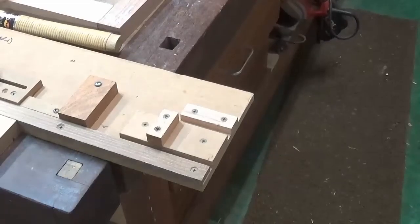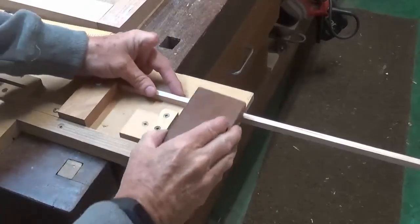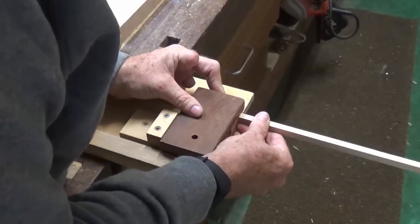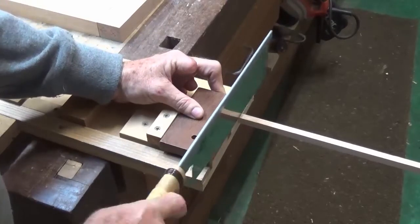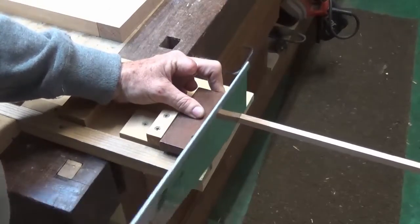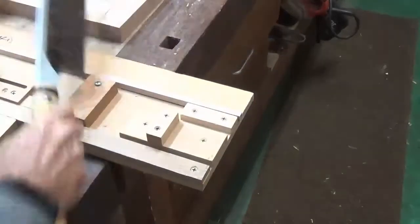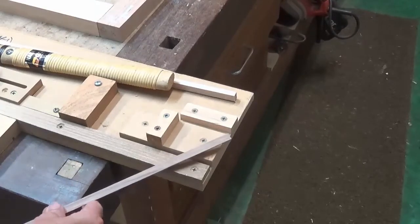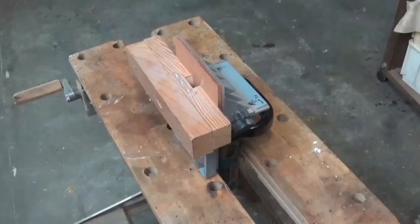And those cuts ensure that when I trim the end down to form the round spigot or dowel type end, it will always have a nice clean cut on the end. In this little segment I'm showing how I cut them to length prior to putting them into the jig to do those cuts around the end. The block that I use ensures that you get a 90 degree cut, and the Suzuki saw cuts a very fine cut.